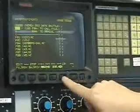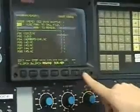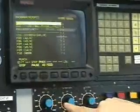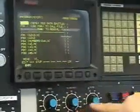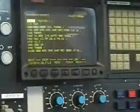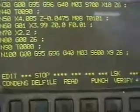I'm actually going to do a quick check and see if I've got it there, and I don't. And I'm going to punch this file out, and what the DS2 will do is sense it and decode what's in the file and get ready to send me the file back. So if I read program 1213 and hit execute, the remote command from punching out the file 0 brings me the file that I want. Now, it's back to flashing, it's back to auto mode, and it's done a complete cycle.